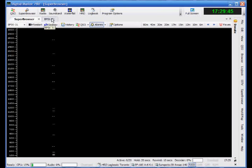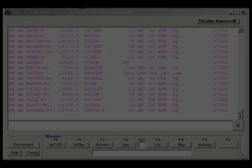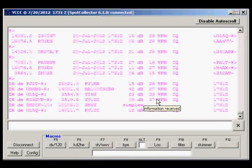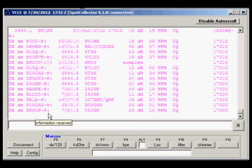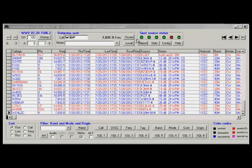You can bounce around different windows. If I were using a digital mode, you could go to the super browser, which would show all the different stations that are transmitting and what they're saying simultaneously, and then you could double-click on that and go to the frequency. This is one of my sources — you can see how fast they're coming in from the skimmers, as well as people that have directly inputted it. I filter my spots to just the northeast U.S., because there's no point in trying to work a station that's been spotted from eastern Europe on a skimmer over there. So I limit it down to just the eastern U.S., but you can see they're coming in from all over the world quite rapidly.